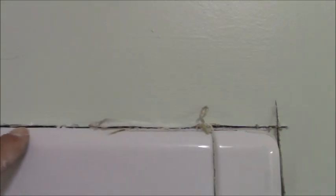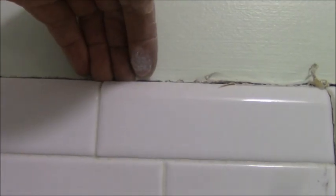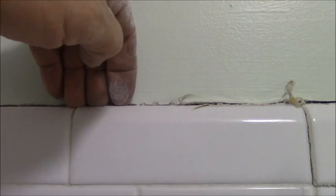Anyway, the other thing I did is I took my Dremel tool and I cut around the perimeter of the tile. So that was pretty quick and easy, as you see. Right at the edge of the sheetrock and the tile is where I do the cut. The next step, when I'm doing my Dremel, I hit these studs so I know where my studs are and I mark where they're at, and then I can get my pry bar inside behind that stud and push out so that I have some backup by virtue of that stud when I start pulling out the wall.